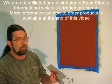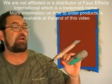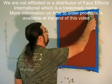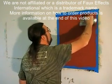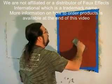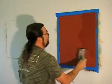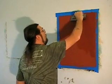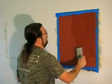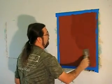All I'm doing is only putting a little bit on there, because what we're going to do is a tight skim coat. What I like to do is work wet on wet. All you're doing is scraping, putting it on, scraping it off. Pretty simple process. You don't try to overwork it, because you're going over this. You're doing this for 2 reasons: to give you a slick finish, and it's also going to give you a layer for the texture to stick to.